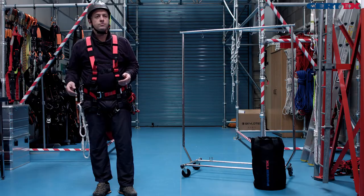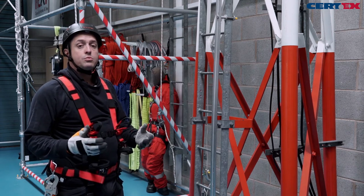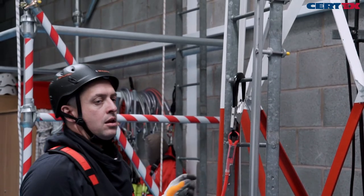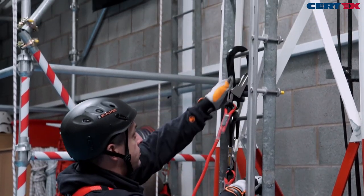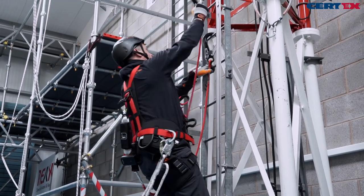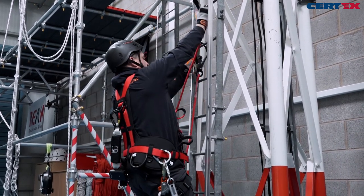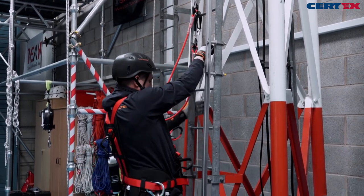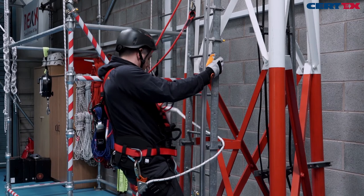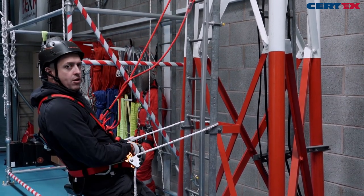Now with the Powertex riggers kit we're going to look at climbing steel structures and vertical ladders. This is a bigger harness with more padding and more comfort for a longer duration of work. With the twin fall arrest lanyard I can connect to the tower at all times. When I get to a position I want to stay and work in, I can take my pole rope around the structure and back into the side D-rings, and lean back in the harness — big padding, lots of comfort, I can stay here all day long.